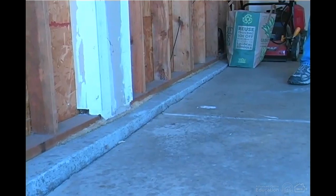You want to look closely at the foundation walls, because since the soil on the outside of the wall is exposed to snow melt and runoff, you can wind up having problems from expansive soil or soil freezing. Expansive soils are usually clay-based soils that expand in volume with changes in soil moisture content. So if the soil beneath the foundation expands, it pushes the foundation up, and foundations aren't really designed to resist those kinds of forces. If you see cracks on the outside especially that are bigger at the top than on the bottom, that indicates there's been heaving, and expansive soil is often a source. The other source is freezing. In cold states, when water freezes, it expands, and so it winds up cracking foundations.